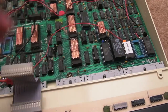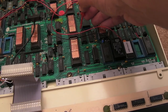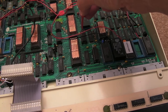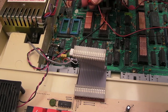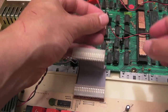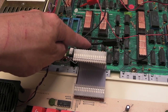If I just slide into the socket — there we go, it's a pretty good fit. The red wire is the write enable. I'm going to label these up with the pin number and what it is, just so it's obvious, because at some point when I take these off I'll forget where they went. In one guide it suggested connecting the write enable to pin 1 on IC14 — that worked with Astro Blaster, which detected the additional RAM — but Exile hung every single time. Then I followed 1024Mac's advice of using IC77, pin 8, so that's where our write enable is going. The other pin just needs to come across to IC76, fourth one up. The select line, depending on which one you use, determines which bank it's in.